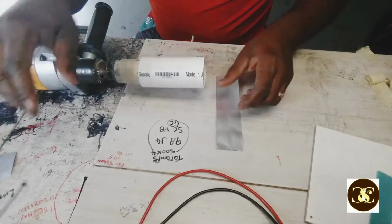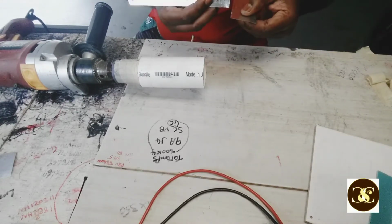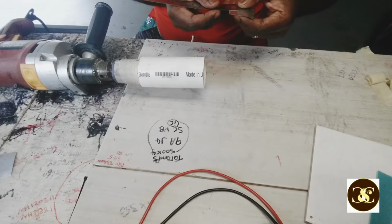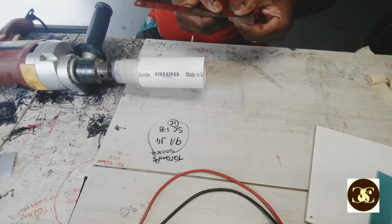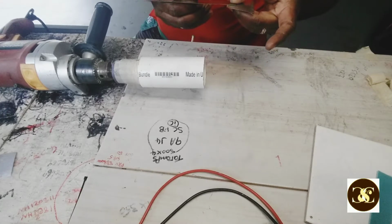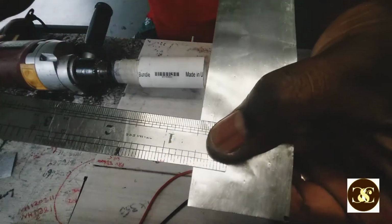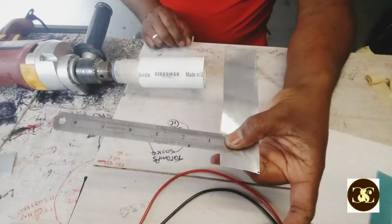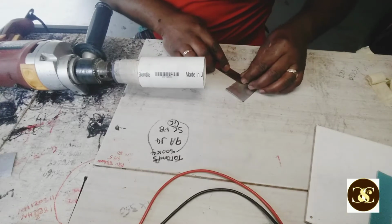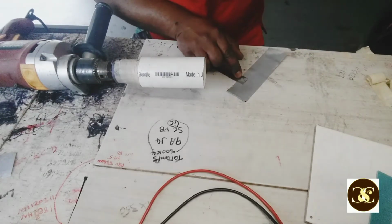I get this little ruler. To make an 8 ohm voice coil from a 30 gauge wire, let me see now. Yeah, a half inch there. Yep, I'm gonna use half inch. So I need an 8 ohm voice coil, and with a 30 gauge wire, I'm gonna need half inch of coil winding space for me to wind the coil on. At least half inch.